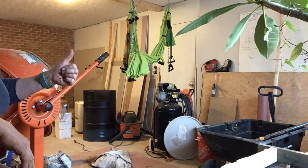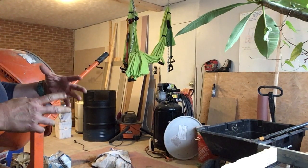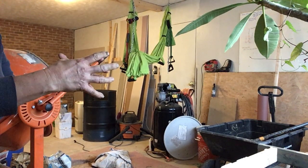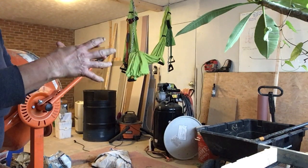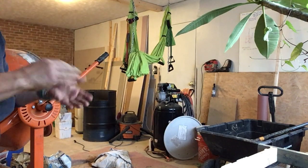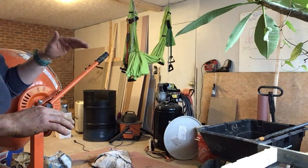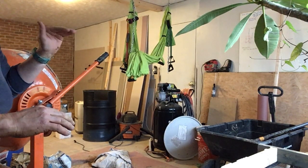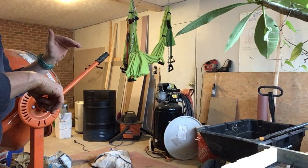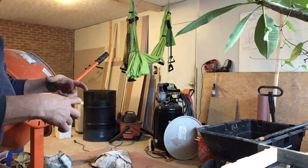The fire brick is rated for 2,600 degrees, and the first part of the heat riser is, in fact, fire brick. So the first 9 inches is fire brick, and then I'm going to place the castable over the top of that. I'm also setting the barrel so that I can pull the barrel off, so there will be two. For a combined height of 50 inches, the riser will come to 48 inches, and I'll be able to unsnap the barrel at 35.